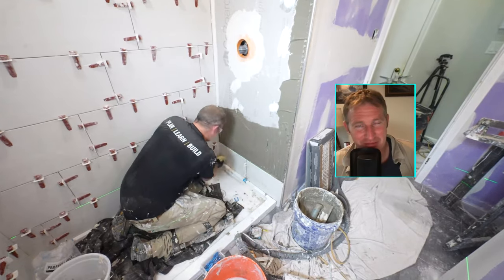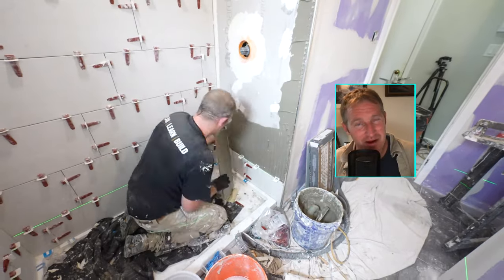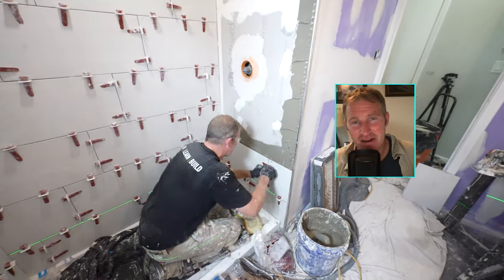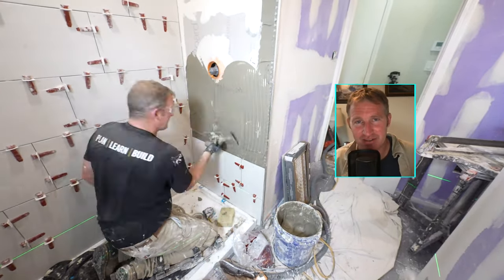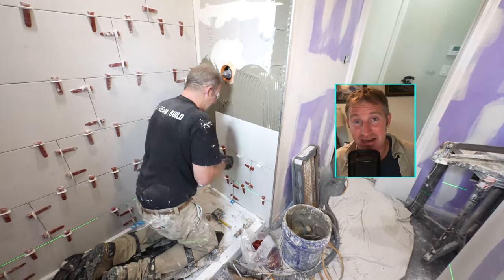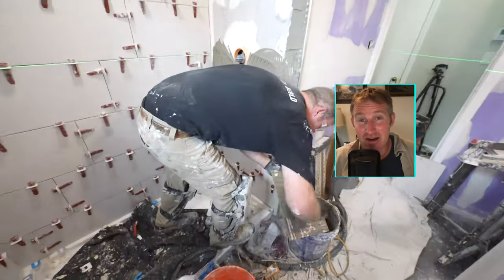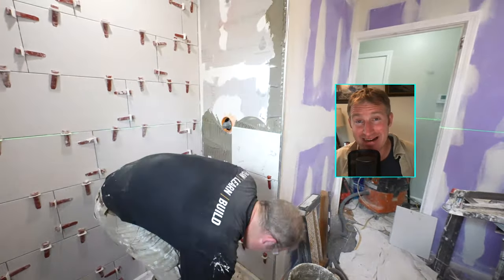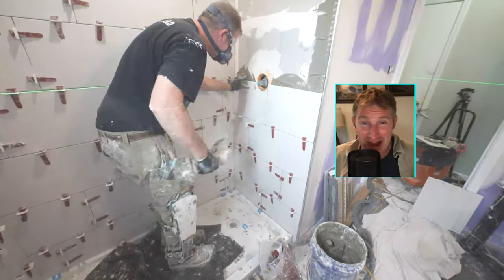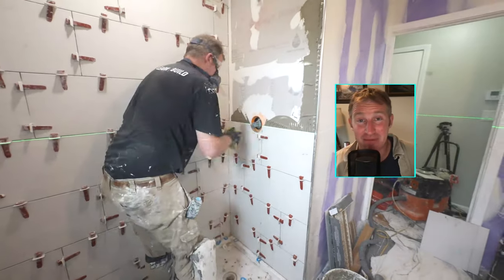Okay, so the plumbing wall, more of the same. You're definitely a pro at this point. Just be sure when you are buying Rondec and you're selecting your metal edging to get the same size as your tile. That usually always works well for me. So if you have 3/8-inch thick tile, get the 3/8-inch Rondec metal trim so that that evens up nicely. And then when you're installing it, especially even on this outside corner, make sure you shim that Rondec out to cover the edge of your tile. As I was stating, you're overhanging the outside wall with the Rondec, so you're going to be able to fill any gap that you have there.